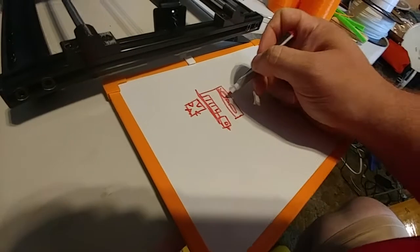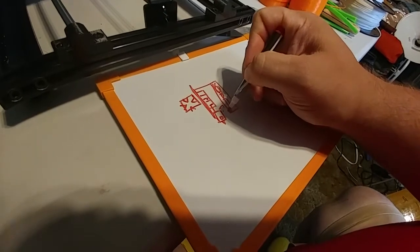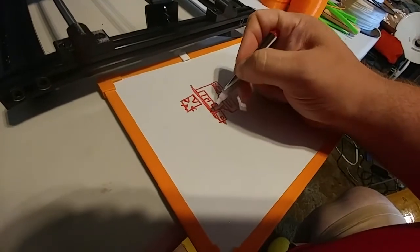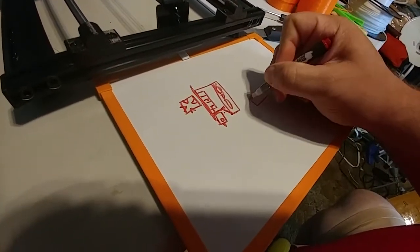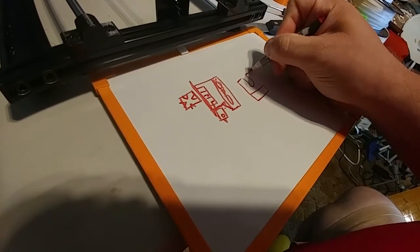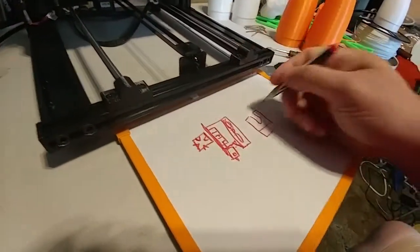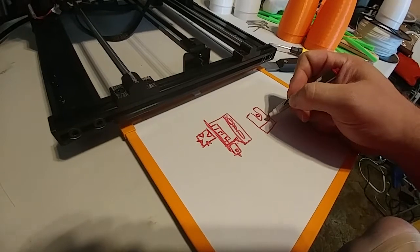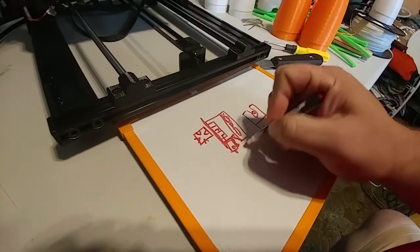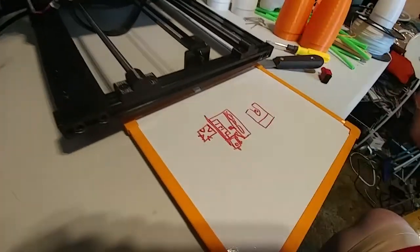This fan is supposed to cool this, but as you can see it's blowing air all over the heater block. All you would need is a metal plate that comes up like this and across like this with a slot in it, so it fits right over the top of the hot end. From above it would look kind of like a U-shape — angled down and across the top of the heater block. It would be a permanent part of this: when you slid it on, the slot would go over your heat break, preventing most of the air from touching the heat block and directing it all over the cold end where it belongs.